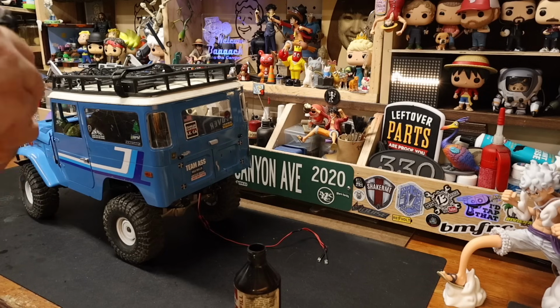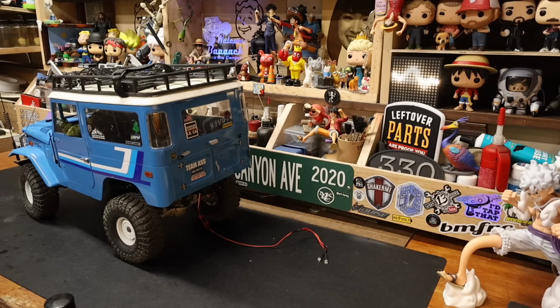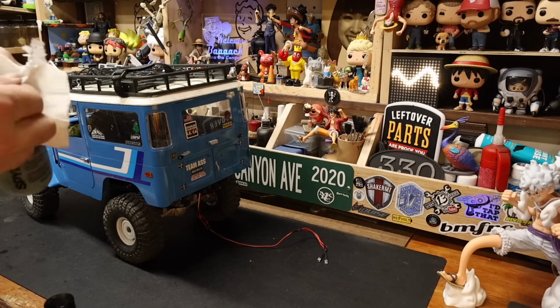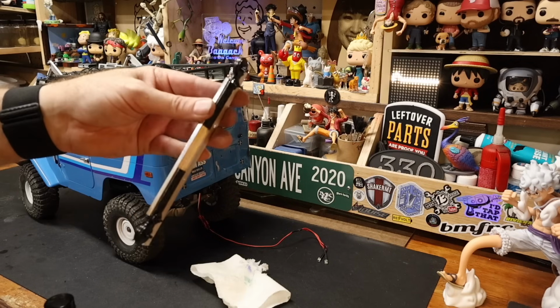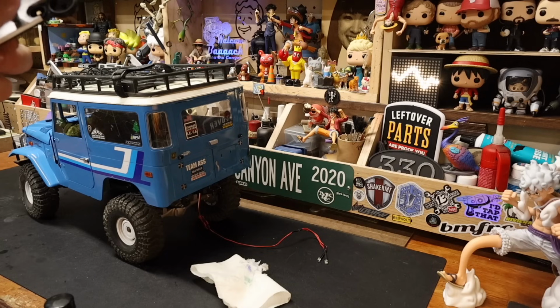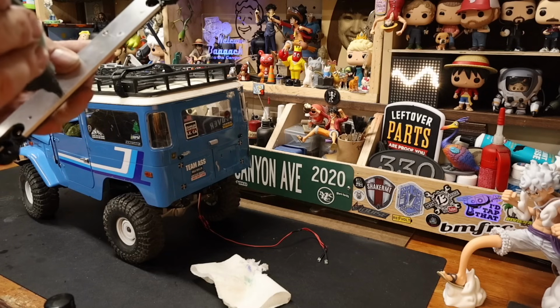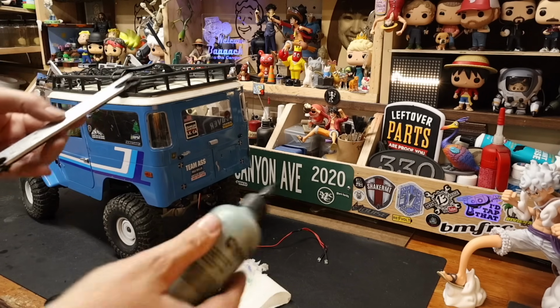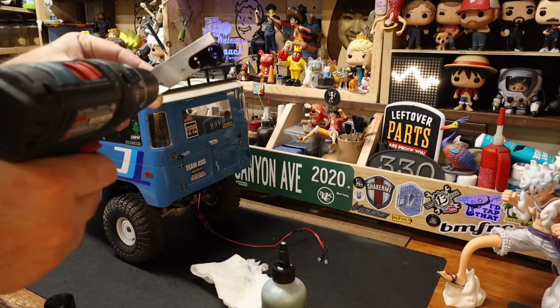Let's close the glue, and we've learned from prior experiences, always cap your kicker. So I had grand plans, and luckily I was quick enough to stop myself before I attempted to execute those foolhardy grand plans, which is, you can't countersink those. That material's about 4 millimeters thick, 3.5 millimeters thick. And if we put a countersink in that, it's just going to blow out the backside. There's a plug in this, and I'm afraid I'm going to shoot the goo. So I drilled it 2.5, could have drilled it 3, but while we're at it, just run a tap through.